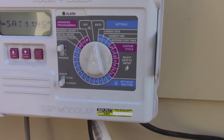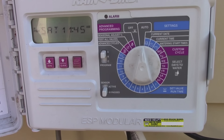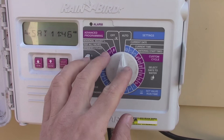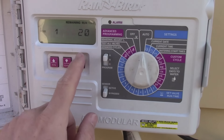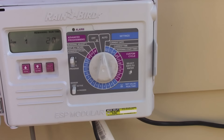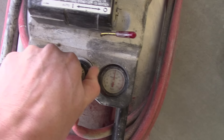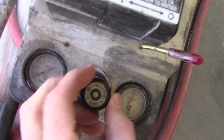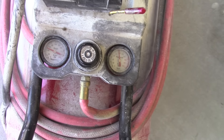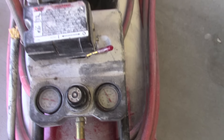Next to your sprinkler box, you're going to want to go through the stations so they can be open and the water will blow out, then the air will blow out. I have these on advance — if I push this button it just goes through. Right now the first station should be open, so we'll go take a look at that. The tank's up to about 100. I'm going to fill the hose line. That's going through, I think, the drip system. So that's flushing that out.